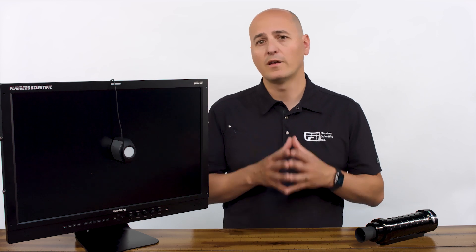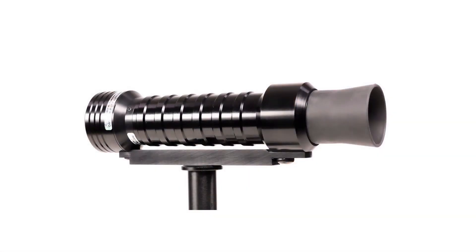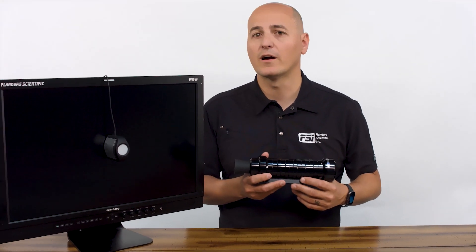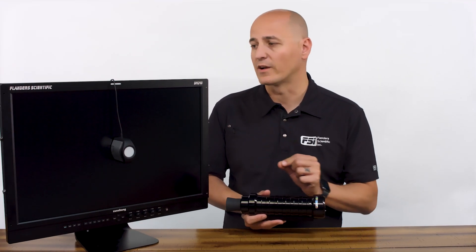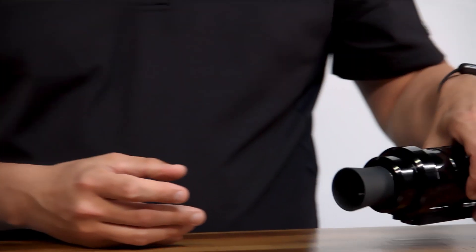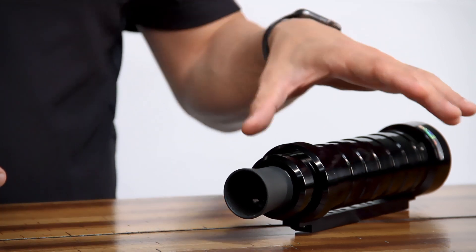So why is this special, and why didn't we introduce the i1D3 integration any earlier? Well, when we first introduced Volumetric AutoCal for the DM Series monitors, we initially supported very high-end colorimeters like the Colorimetry Research CR100, the Klein K10A, and the Minolta CA310. These high-end probes all share one really important feature: the ability to save display-specific matrices directly to the probe's memory. For example, I can take this CR300 spectroradiometer and create a display-specific matrix for the DM240 in my colorimeter, then make an additional matrix for a DM250 OLED. By creating these display-specific matrices, I can ensure that my colorimeter will read the specific display in question very accurately. As for why not just use a spectroradiometer directly — they measure too slow and they're just too expensive for most users, so colorimeters are really the best option.